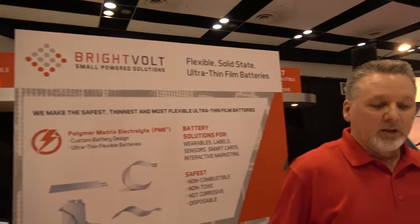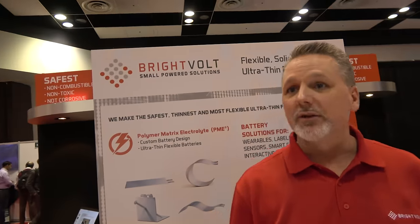So how about when it's rechargeable — how many recharge cycles can it do? The goal will be 300 to 500 cycles, just like you would find in your conventional rechargeable cells. But you will also still have the ability to flex the battery. The flexibility is what most of our customers are looking for, besides the ability to get the same voltage at 3.6–3.7V and the same types of capacities they see today. Capacities can run all over the place, but we're going to probably start with something in like 50 milliamp-hours up to 600–800. But if someone came to us and said, I want a 2 amp-hour battery, we could still manufacture that — give them the capacity they need in a safer battery, but still give them that level of flexibility for things like clothing.